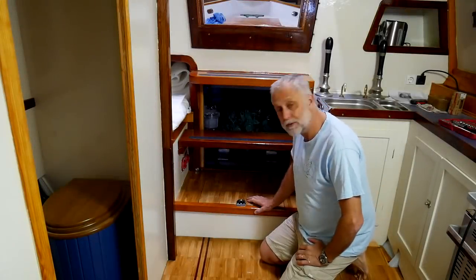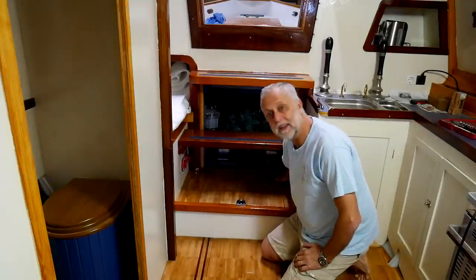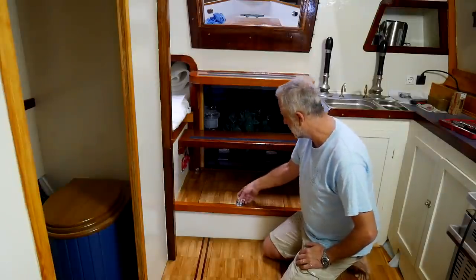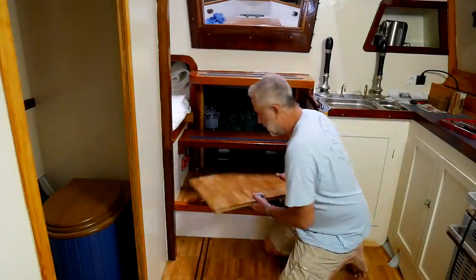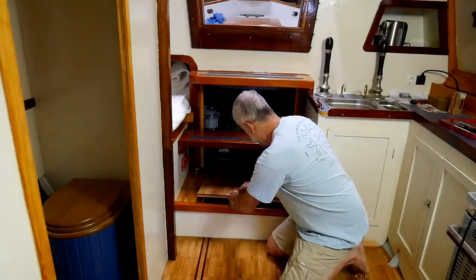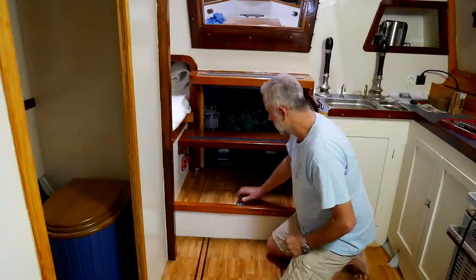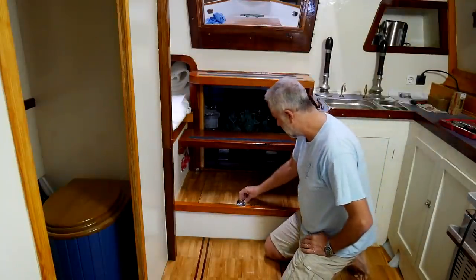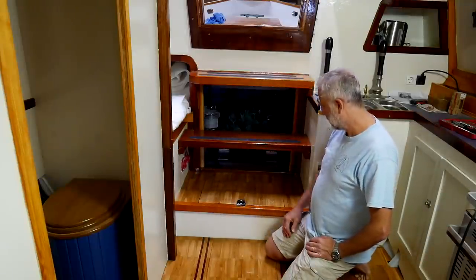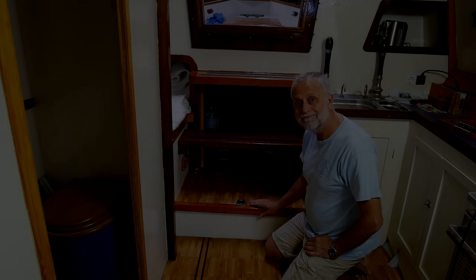Nice. Companionway steps, got that done. You might remember last week I made a batten up, it was in the workshop, and I just screwed that in position there. Fitted this catch to the board, and you see the back end of that board slides under that batten. And the whole thing just sits down there like that, and it's well and truly held in position. Right, well, need to touch up the varnish a little bit here, but happy.